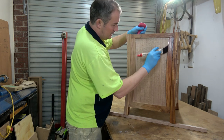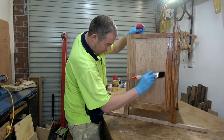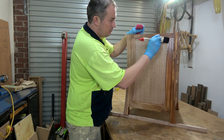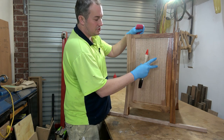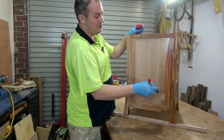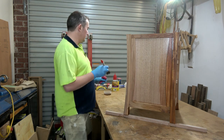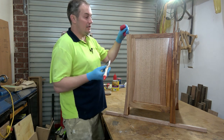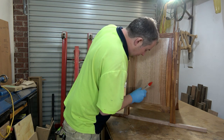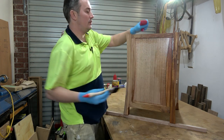I'll also get some oil onto the inside of the reveal around the floating panel. Because this oil is so thin, it will seep in behind the groove housing the floating panel and coat the surface hidden behind the groove — so if that panel shrinks a little bit and exposes unfinished timber, it'll now be finished. The other problem is that the finish could actually glue the floating panel into the groove just a little bit, but the power of the timber will probably break that seal without breaking the timber — probably, hopefully, more than likely.